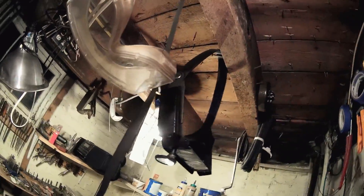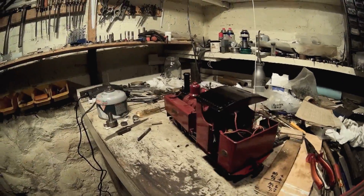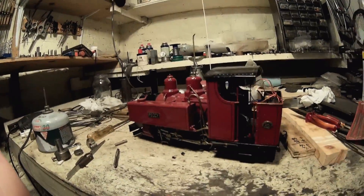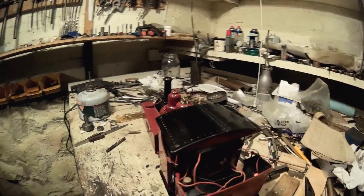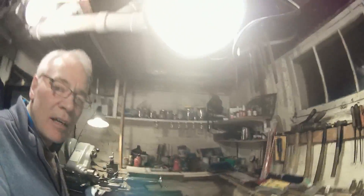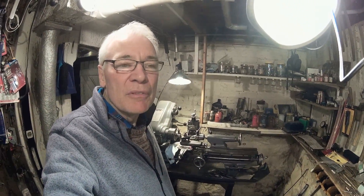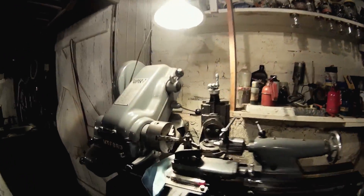Here's my workshop. You can see it around me. The laser in the background there, the goggles, magnifying glass. Peggy's here on the bench having her regulator remade. The regulator froze up because it wasn't open — it's not really made that well. So I'm remaking it on the lathe here.